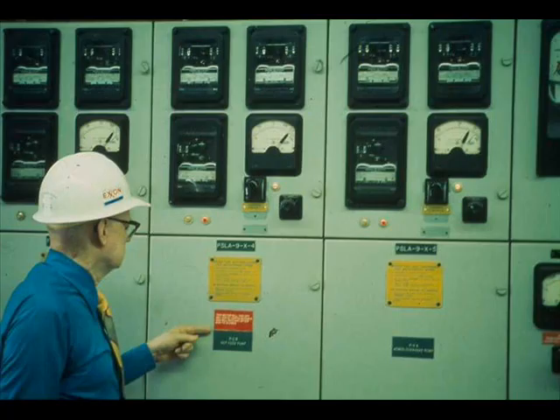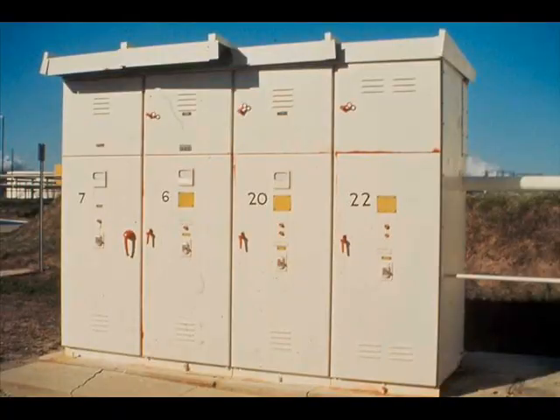This action does not directly start the motor, but sends a current to a motor starter or controller. The starter may be housed in a substation, like this starter for a 2,300-volt motor, or it may be in an outdoor cubicle. This starter is also for a 2,300-volt motor.